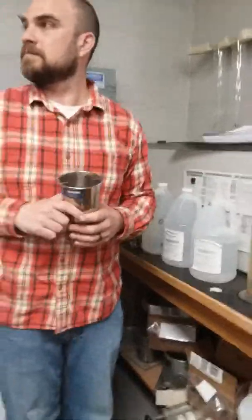Some people don't have a water bath which can hold it to a constant. So the water can come out of the tap at a certain temp, and as the day goes on, by the time you get to your last reading, the water is a lot different temperature-wise than it was originally. Once we get our final reading, we wash that over the 200. Dry that material, and then we sieve it over our 50 and 200, or 35 and 200.